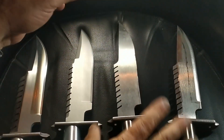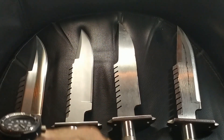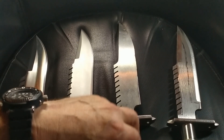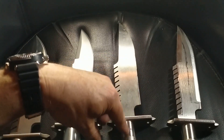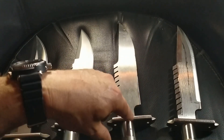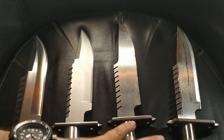All the handles are stainless steel — I think it's 304 — but it's pretty thick: 2.7mm thick. So it's not breaking. You've got a 17mm tang and then M20 threaded rod on both sides. All M20 threaded coarse threads in all three of these.